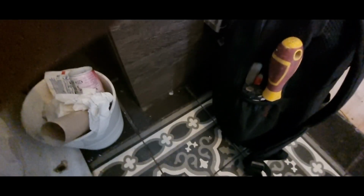Aye. Yeah, I suppose I'm wondering if we caught it when my dad. Don't know if I'll get a reading from the flooring. There. 39%. That's on the floor. That's where the grout's been peeling off. Let's try this bit here. 35%. Yep.